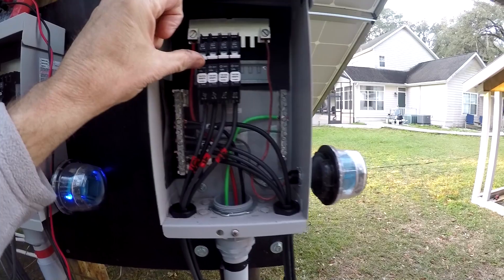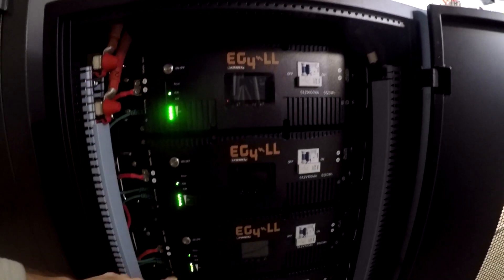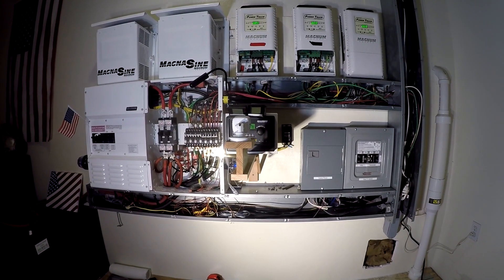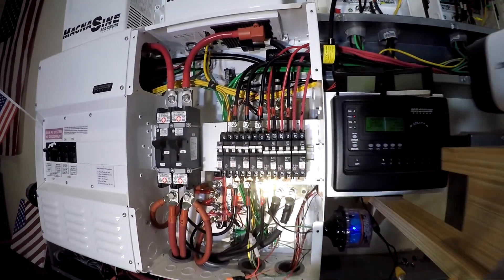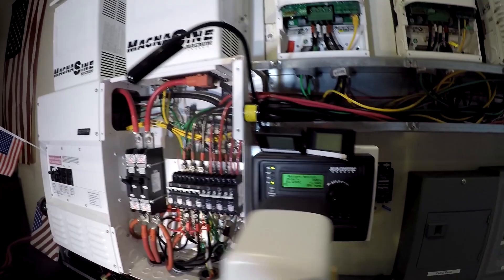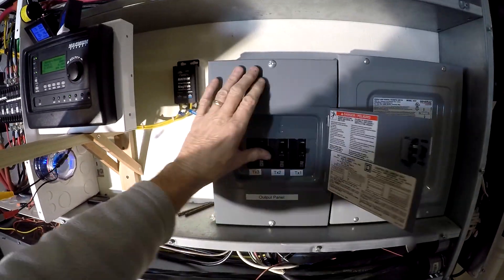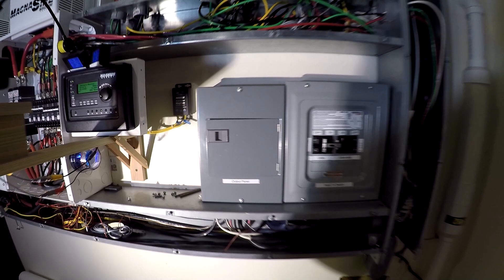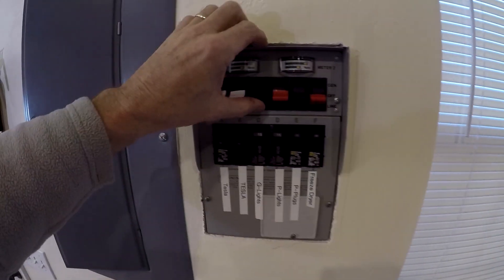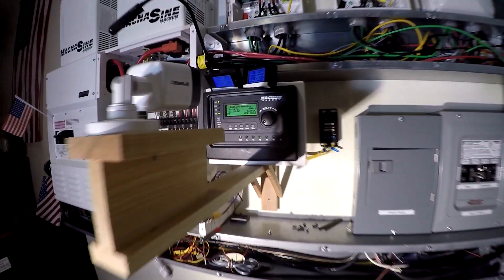Notice that guy comes on. It did boot up on the third try — I started three batteries at once and that seemed to work. Looks like we're booted up. The next thing I'm going to do is start the inverters and put some load on here. Switch the output on — it turns on the three transfer switches. Now everything in this room is on the system and we're pulling five amps. It's looking good so far.